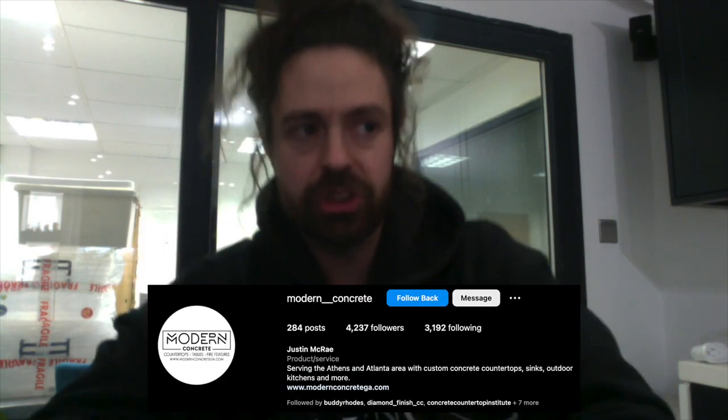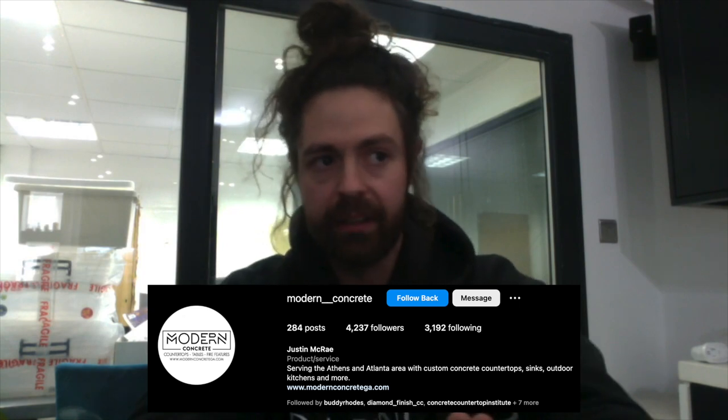Bonkers. Yeah. But then the thing is, because of the way I'm grouting with that green pad and taking all the excess off, I'd never just spot grout because there's always that chance of ghosting, but there's hardly any work the next day, and the wet polishing and the acid don't open up more holes. So that's the way I grout. That's my secret. And Justin McRae first told me about the buffer many years ago, so I have to give him the credit for that.